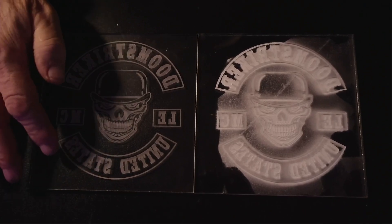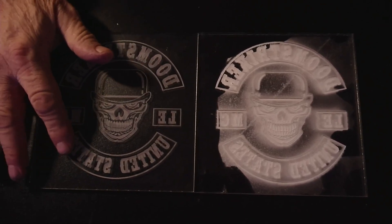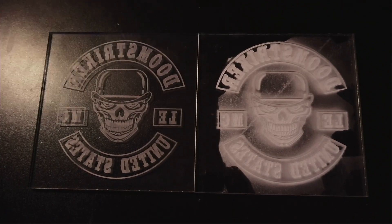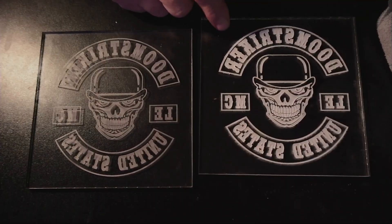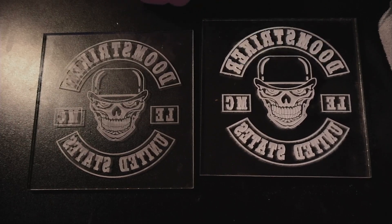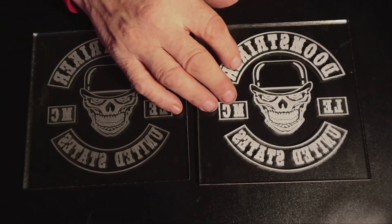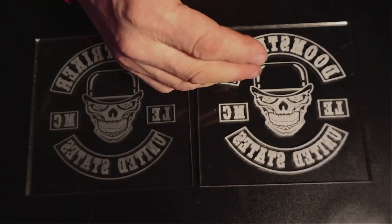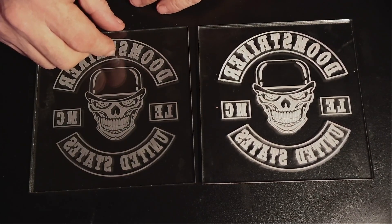It's pretty obvious — there's no powder here with the external air assist. There's hardly any powder at all and when you rub your finger across it you can barely feel anything. It almost feels embossed rather than dug in. This works perfect for lighting up acrylic with LEDs. On the other side, running straight through the nozzle, you obviously have a lot more powder. That's the perfect result if you're going to use it for a plaque or a regular piece that's not going to get lit up — it's super white and will stand out fine. Theory is: the less depth, the less power it takes for the LED to light it up.